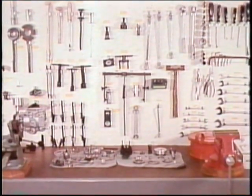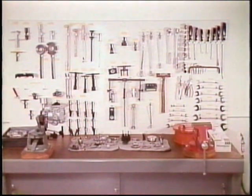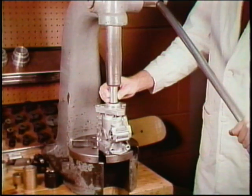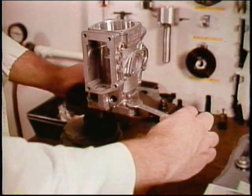You start with a clean working environment. Before assembly, dip all parts in clean test oil. Begin by pressing the drive-end oil seal into the housing. Next, using the correct mounting flange, secure the pump housing in a swivel vise.